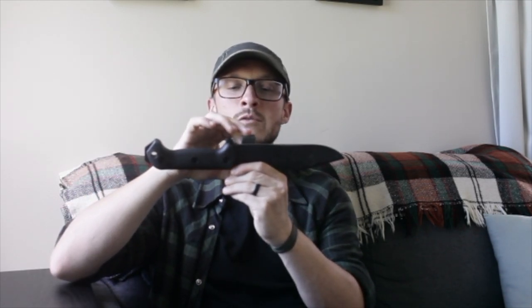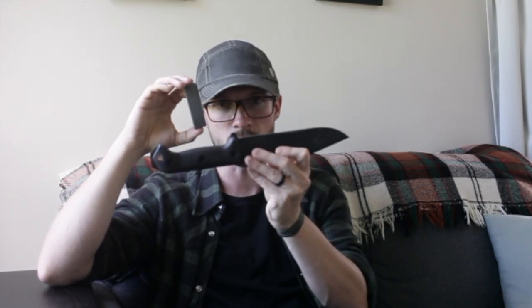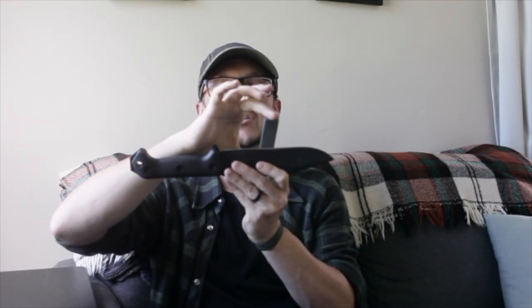Because here's the deal, if you move this stone across just this part, then there are hundreds of abrasive particles that are all getting raked across the same millimeter of edge. But if you rake across this way, not only is it a nice motion for stripping off burr, but also each portion of the edge just gets a couple of abrasive particles to take that off. So if you're having trouble getting your coarse stones to stop raising a burr when you don't want them to, give it a try with a bit more lateral side-to-side motion and see if that helps.